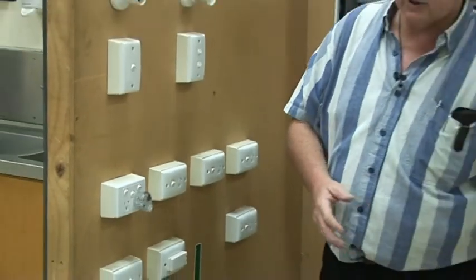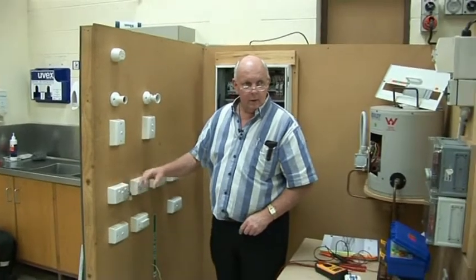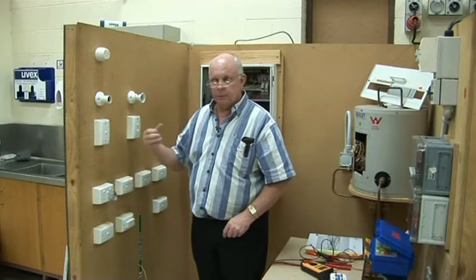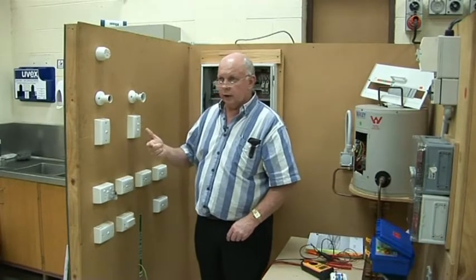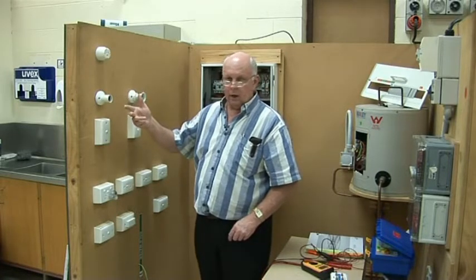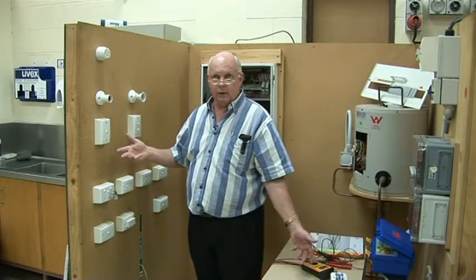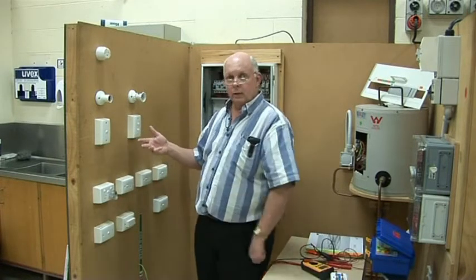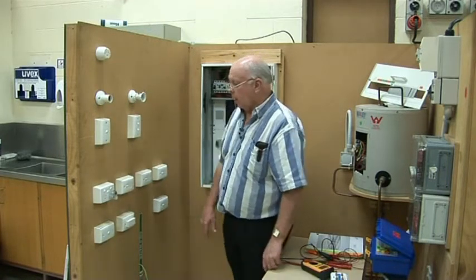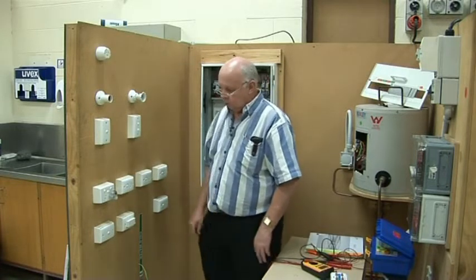So the MEN link, the active going through that breaker, and the correct neutral bar is the way we should really do it. I go to the point I'm testing — it doesn't matter what order. We need to get 15 ohms across active-neutral. I need to operate the switch to make sure it's working in the active. Going to earth-active I should get 10 ohms, and it should open up — that confirms the switch is in the active. As a triple check, going to earth-neutral I should get 5 ohms and still get the same 5 ohms, because the switch should not be in the earth or neutral. We're checking that all wires are going to the right place — polarity, neutral, active switched — and we'd pick up shorts and opens in the cable.